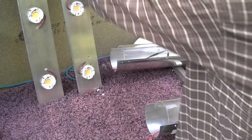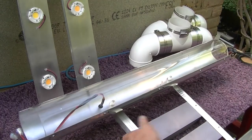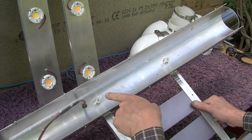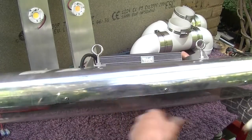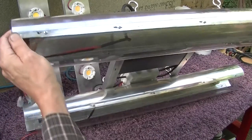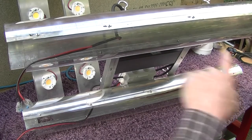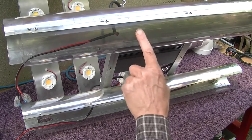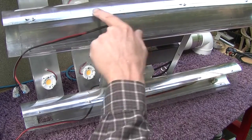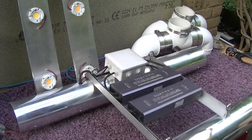That's the two arrays — nice and serviceable. Here's the detail of the fabrication: we've got wing nuts coming through from eyelets in the top, a simple aluminium frame, and a 130-degree slot taken out of a piece of aluminium tube with a half-pipe of acrylic, all silicone-seamed and screwed into place — nice and structural.